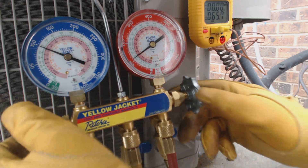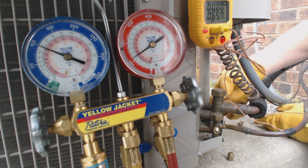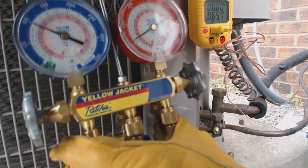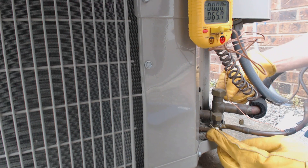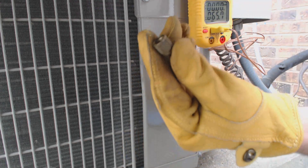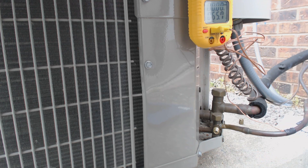So we're about there. Now we can go ahead and disconnect over here — not losing much of any refrigerant at all. Make sure that you're checking here and here before you put your valve caps back on, and make sure there are no leaks. You can do that with bubble micron leak detector. Hope you enjoyed yourself — see you next time. AC Service Tech channel.